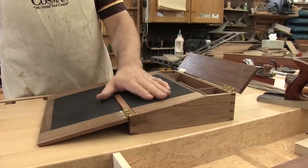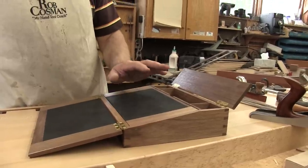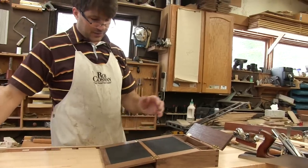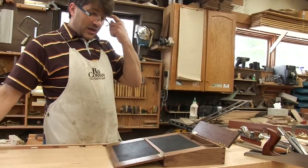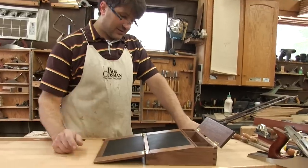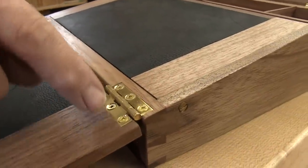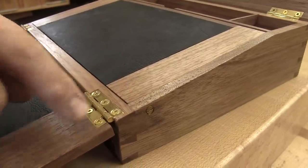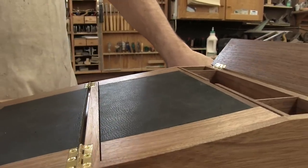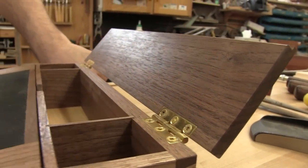I did a few things on this that I would change. Number one, I used textured leather — it should have been much more a smooth leather to provide a nice writing surface, but that can be changed. My biggest problem was in finding good hardware. I paid quite a bit of money for these solid brass hinges, but it's as if the people who make them never actually use them. I had to drill them out numerous times in order to get the heads of the screws to sit flush, because if they don't, the hinge won't close. And you can't get screws this small, so I had to take the screws and cut them and point the ends.